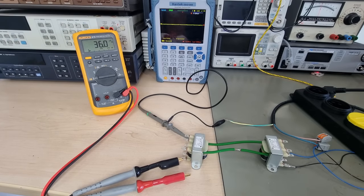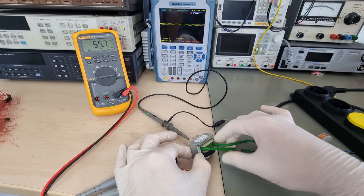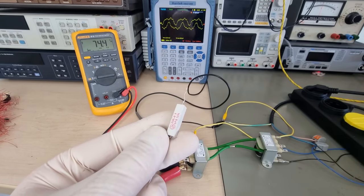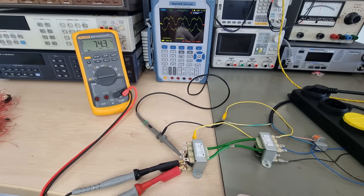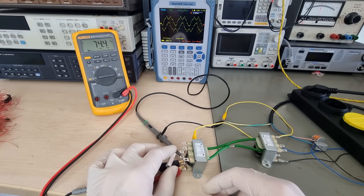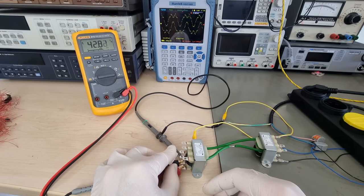Unless you want to continue this quest and find out how low we can go — I guess that'd be the vault-nutty thing to do. How about we mutilate two of these great performers, gouge out their secondary windings, and couple the cores with a single turn each? That gives us a bit of an inconvenient output voltage but common mode leakages in the same league as the 3458A. Unfortunately, the AL — the inductance per turn of a laminated steel core — is not that great, so the output voltage sags massively under the slightest load. I don't think we could even get a watt out of this pair. But this experiment sends us in the right direction — I think we want fewer turns.